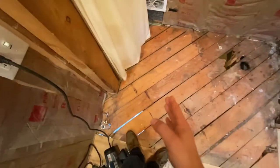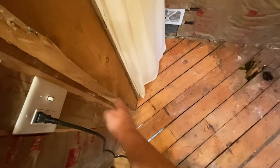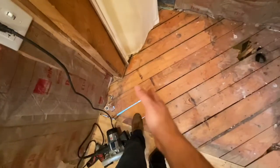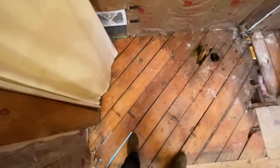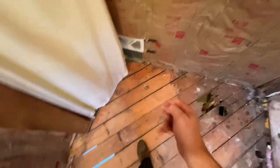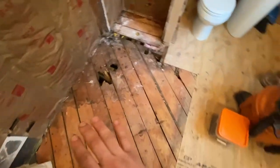Now the last floor joist in the floor is right about here. The next one is underneath this wall and underneath the wood floor in our bedroom, so I can't get to that one. I will be ripping the boards right down the middle of that floor joist so that it can share with the plywood I'll be putting down in the rest of this bathroom. These boards are perfectly stable from here over — having not gotten wet, they're still strong, so that should be fine. I'll put the plywood in here and then a layer of subfloor over everything to make it all level.